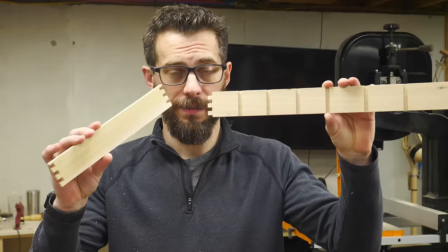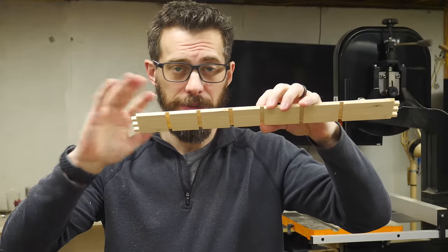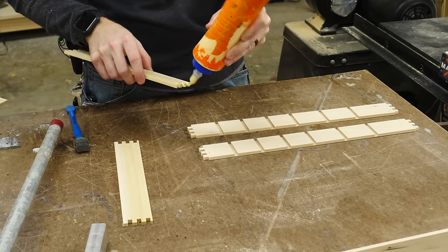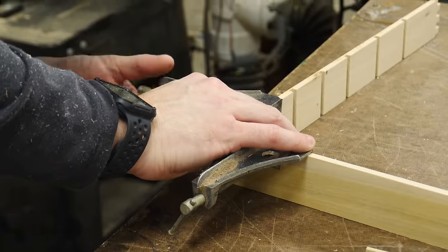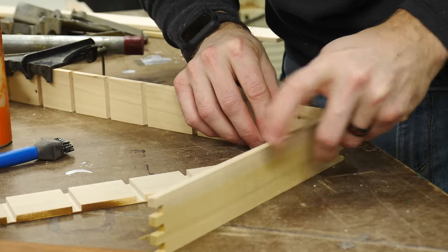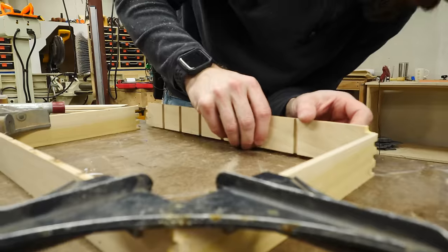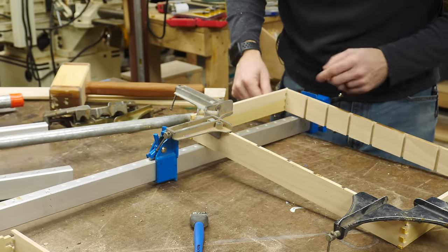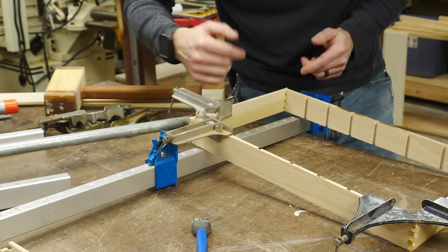Now I've got those cut and I can start putting this box together, but I did make the blade a little bit too high. Those cuts are way too tall and the material is way too thin. Once it's all glued up it should be plenty strong, but I just have to be careful when assembling this that I don't crack one of these pieces. I can't quite get these to seat all the way up just by banging on it, so I'm going to use a clamp to squeeze these two opposite faces together to hopefully close that gap.